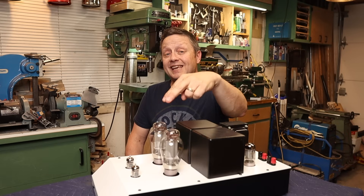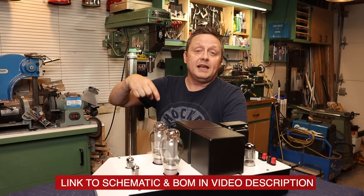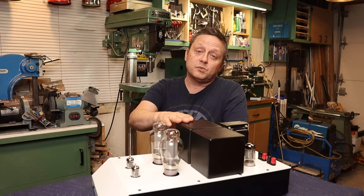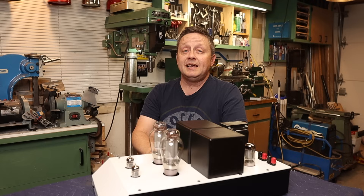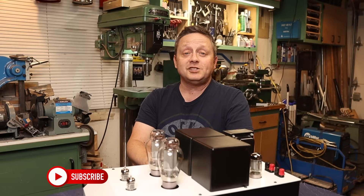I did deviate a little from the original schematic in the article, so I'll put a link in the description for the schematic I used, a bill of materials, and a build document covering different options like different rectifier tubes and output transformers. I run this with a subwoofer so I don't care too much about low bass extension, but if you don't have a subwoofer you'd probably want better output transformers — something like the original Magnaquest ones or the Edcor ones. If you like this build and want a deeper dive, please leave a comment and perhaps I can do another video. Thanks for watching and I'll see you in the next video.